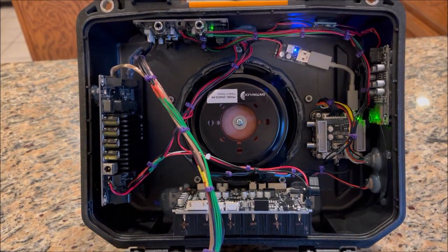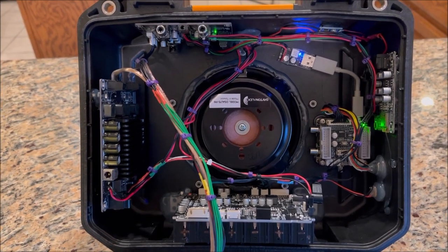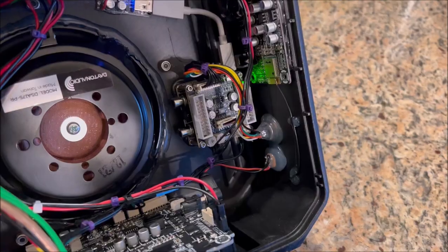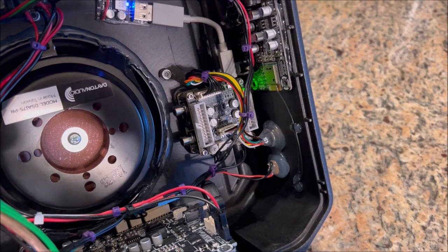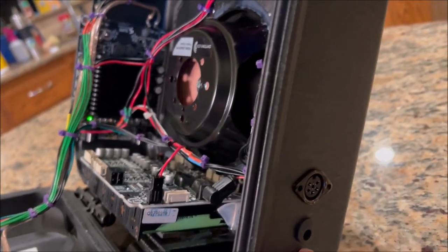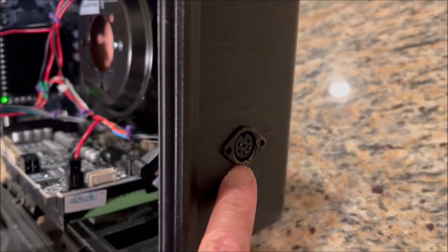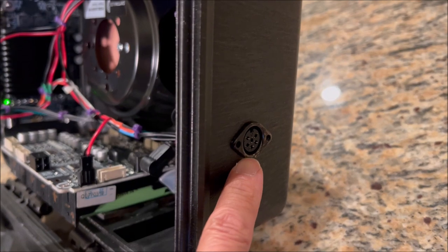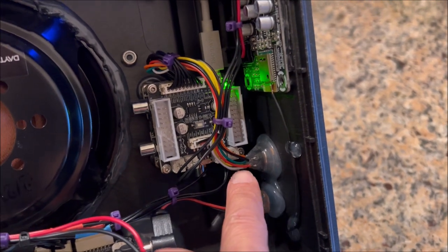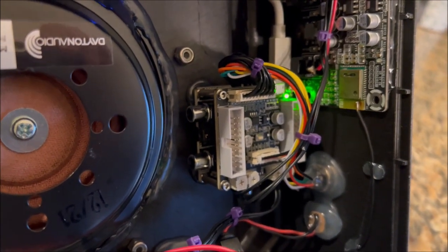That's a quick summary of this little build. Pretty easy — it takes maybe one day, though I spread it out over a few days to add components here and there. Tuning took a little bit more time. On the outside, this single-channel Bluetooth boombox charges through a 2.1 by 5.5 millimeter DC jack. There's also a proprietary 6-pin AV interface that comes out as a multicolored harness connecting to the APM2 DSP stack for programming.